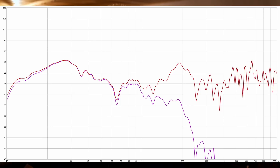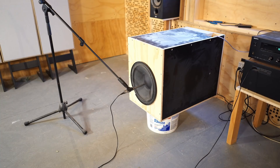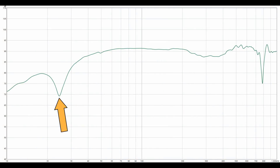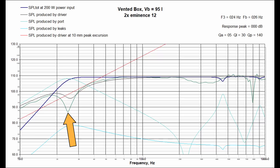All the measurements shown here have some smoothing applied — otherwise it just looks like an unholy mess. Moving on to measuring the sub itself, I started with the near-field measurement, where you place the microphone very close to the center of the woofer. By doing that you get the true response of the woofer in the box without any room reflections. You can see that light blue trace showing the characteristic dip at the tuning frequency, which you'll see with every vented box design. Here's the predicted response from Unibox — that thin black line I'm tracing along — and I've resized and overlaid the measurement onto that predicted plot. They're very close, but the tuning is a little bit lower on the one I built. I can adjust that by changing the port length, box volume, or both.